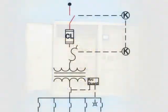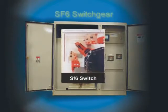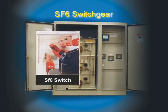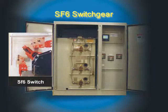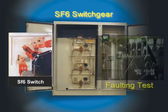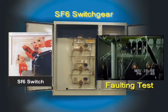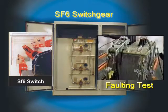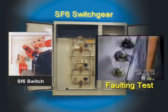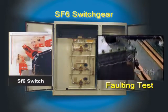The next system improvement is the CSA-certified SF6 switchgear. This sealed switching device provides a safe arc-sealed switching system with no exposed arcing products. For the operator, this video should convince you that safety extends far beyond the standards of an air-insulated switch. Take note that the bushings stay intact after the explosion. As you can see, even if you were standing near this unit in a major failure, it would provide protection for the operator due to the heavy steel construction hardware and support ribbing on the tank.